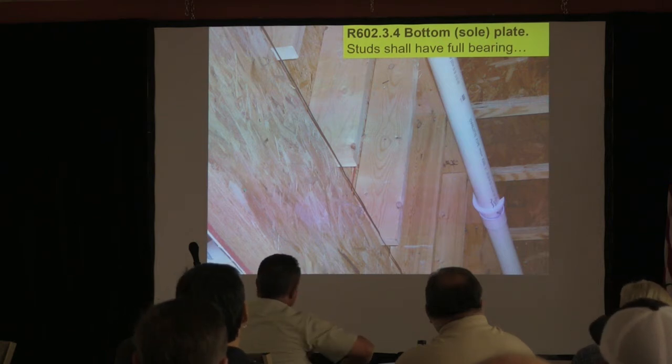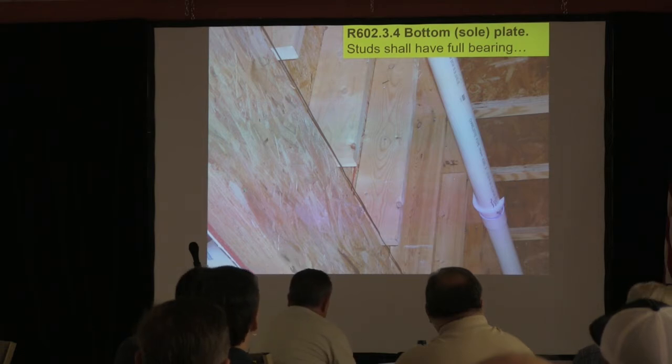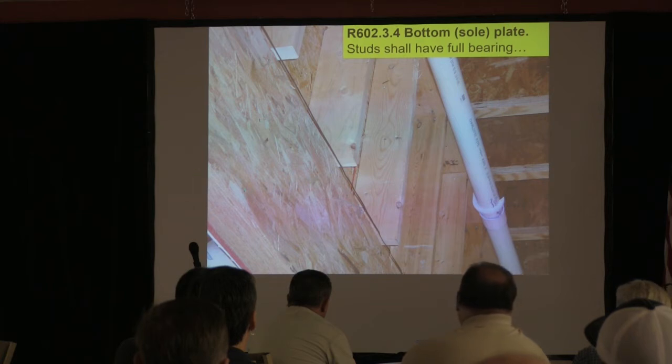Looks like a timber strand, actually. Some of you new guys, I don't know if you know, LVL is when it's veneers that are glued together. This is a variation. They've got strands. It's called timber strand. Typically, they'll span a little bit less than LVLs. But there's just different kinds of engineered products.